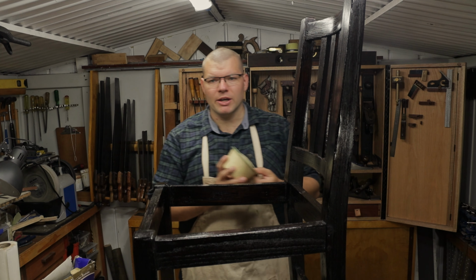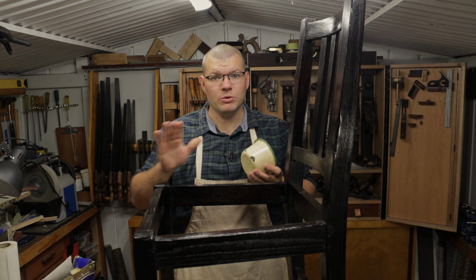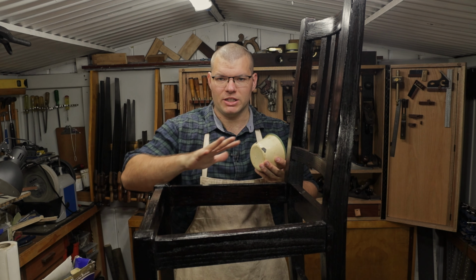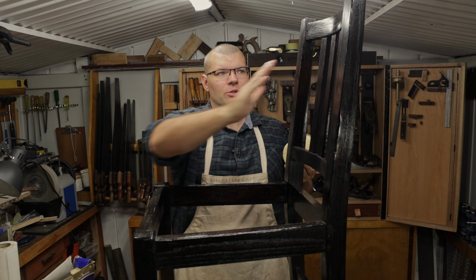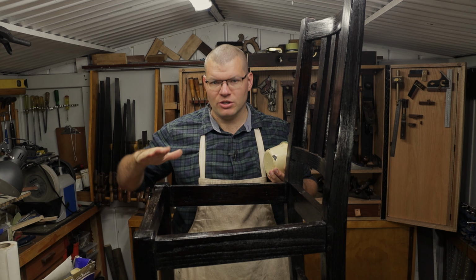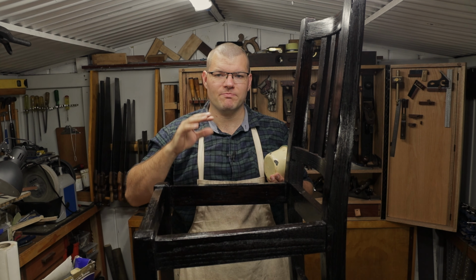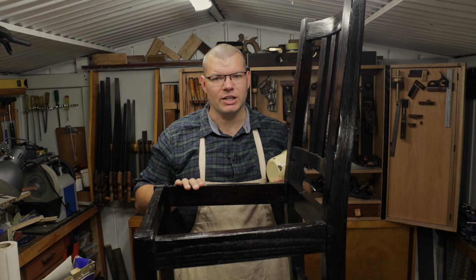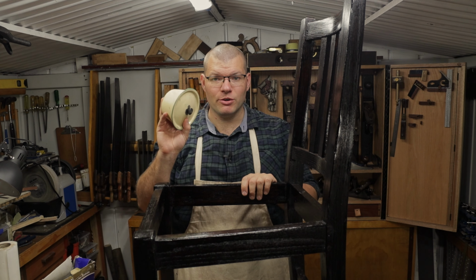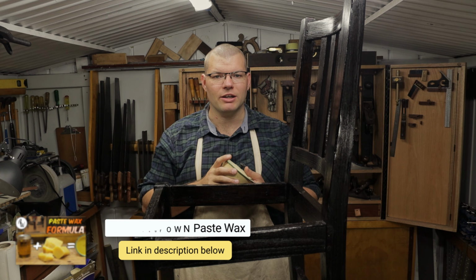Then I'm going to use my homemade paste wax that I've got here, and I'm going to use the steel wool with the paste wax and rub the entire surface over. Now what that's going to do is cut back on the shine a little bit, make it a little duller, but it's also going to even out the shellac that's on here and leave a nice smooth to the touch finish. If you haven't seen my video on making your own paste wax, I'll leave that link below so you can check that out if you need to.